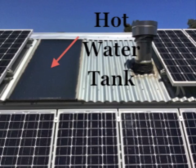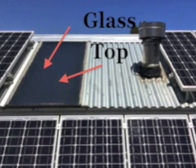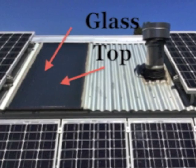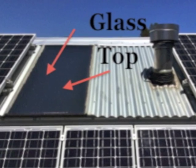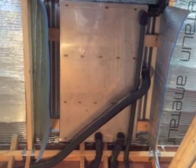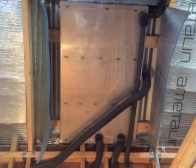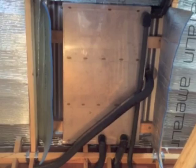What we're looking at here is the underside of the water tank. On the other side of this water tank is a piece of triple pane glass out of a freezer top section out of a supermarket — a friend of mine put me onto this. It allows very little heat to transfer through it, so that the tank on the other side is painted black and absorbs the solar radiation and the heat from the sun to warm the water in the tank.